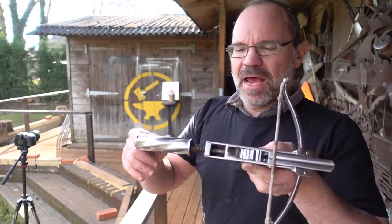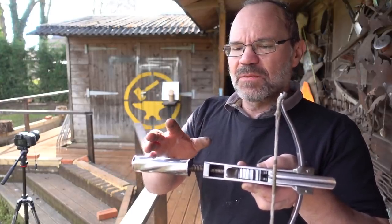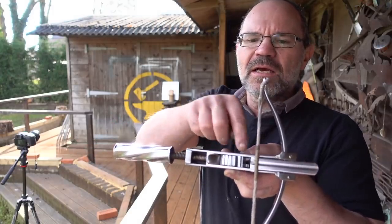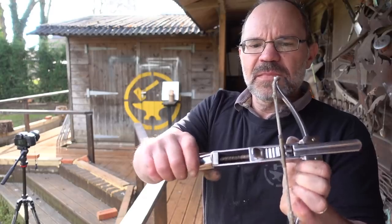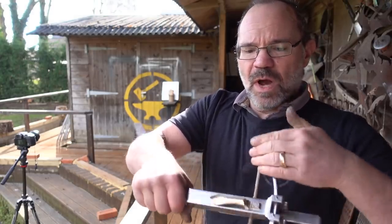These balestrine are incredibly rare — there are only 18 or so of them in existence, but they all work pretty much the same way even if they look quite different. They've got a screw jack and a trigger mechanism that goes forward and is then pulled back by the screw system. You just slide that forward, the trigger is now in, just holding it closed, and then you wind it up.